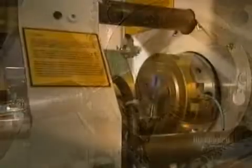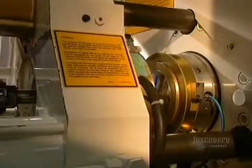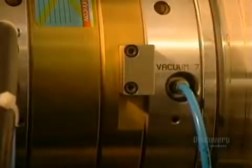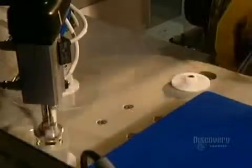Discs are made from a very special plastic called polycarbonate. The mold is closed and liquid polycarbonate is injected into the die. It comes out as a small, hard, translucent disc. It is now ready to be metal coated so that it can be read by a compact disc reader.